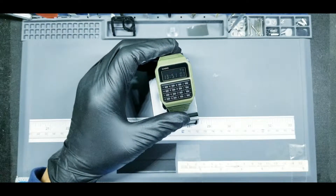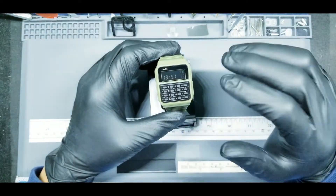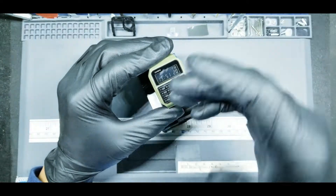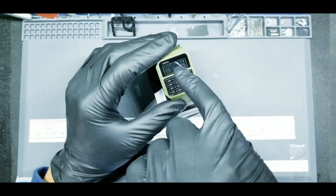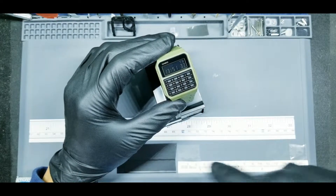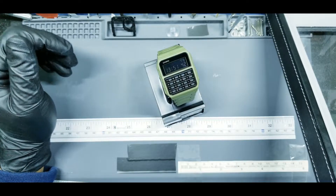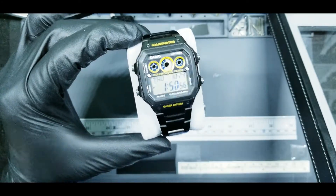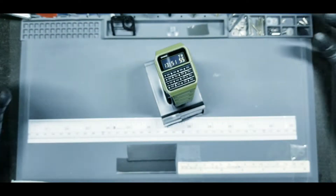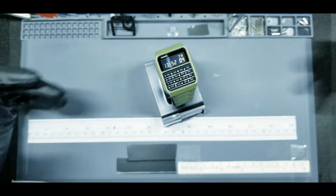I've done a few modifications converting my watches to negative displays and usually the effect I get is much brighter — a blacker black and a whiter white for the numerals, so much better contrast. But I usually have backlights on my other watches. In this case you don't have a backlight option. So what I'm going to do is remove the factory polarizing filter and apply my own polarizing film oriented to give a normal non-negative display — white background with black numerals. I know I'm having a hard time reading this in bright sunlight so I'd like to change that.